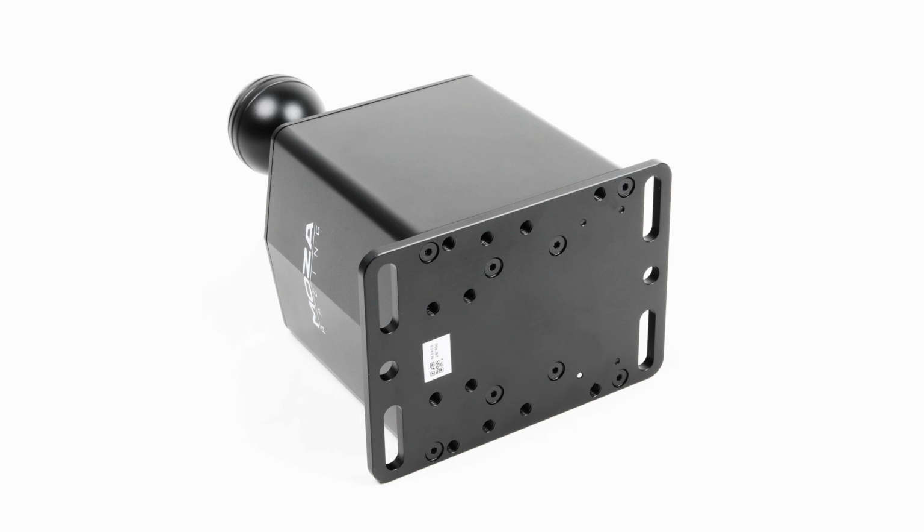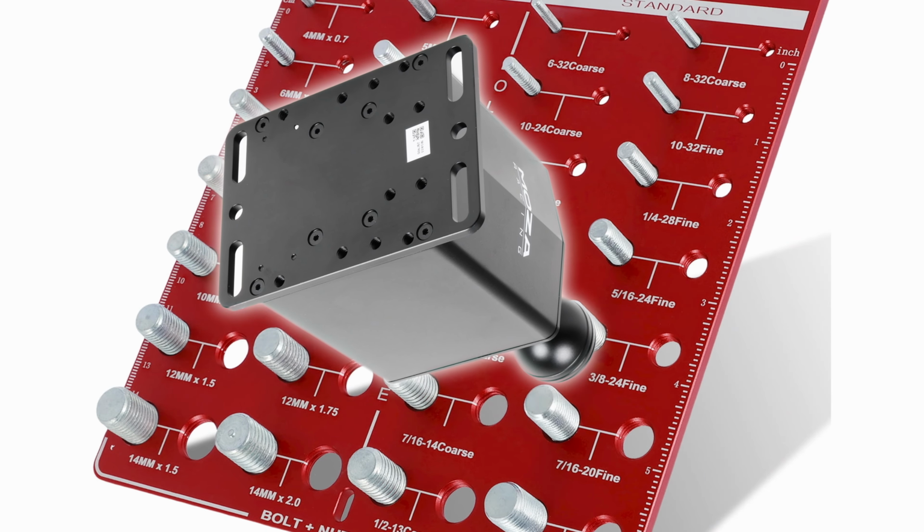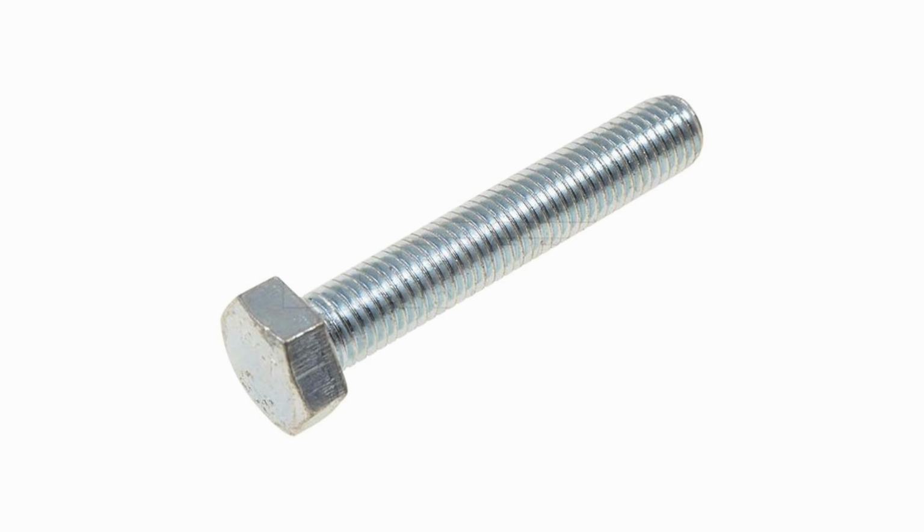On the second Home Depot run, I brought the whole shifter and embarrassingly tried screwing that clunky thing into the test threads. No footage exists of this incident. Fortunately, this time we were able to find the correct thread size. They didn't sell an M7 1.0 tap, so we just bought a bolt and jankily turned it into a tap.